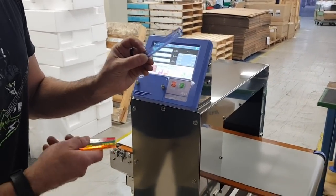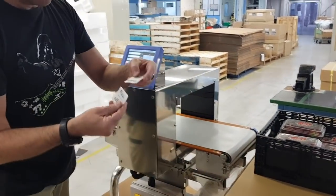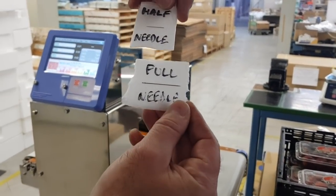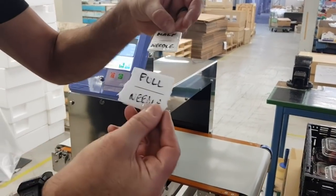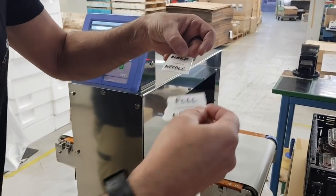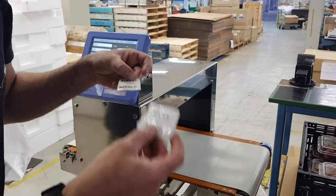It's really important to understand that if you're looking for something like a needle — I have here a typical sewing needle, one cut in half and one full — the reason we don't use pieces of metal like this to check a metal detector is because depending which way it goes through, it will give you a totally different signal.